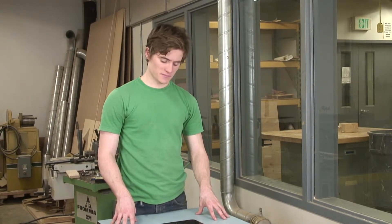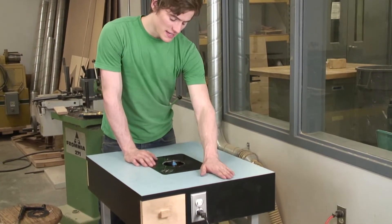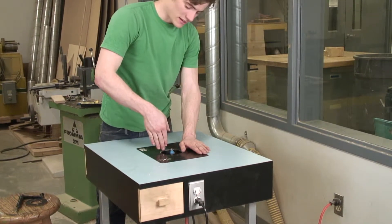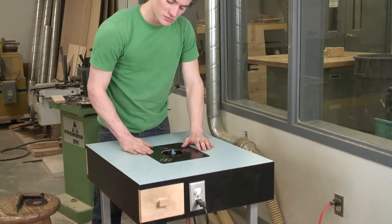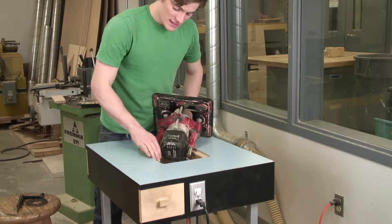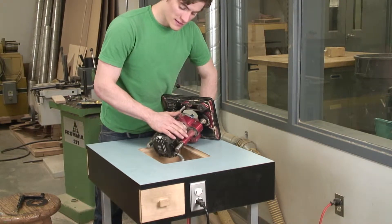With the table router, it requires slightly different configurations. Since you're dealing with basically a plunge router mounted upside down in a table, you need to make sure that everything is perpendicular — this tabletop surface needs to be perpendicular to the shaft running through the router. One way of doing this is making sure the lowering and raising system is flush with the top, and that when mounting the router into the table there's nothing underneath on the inside of the rabbet throwing off its levelness.